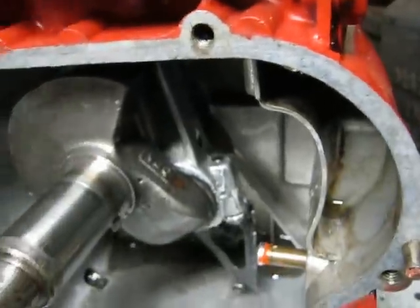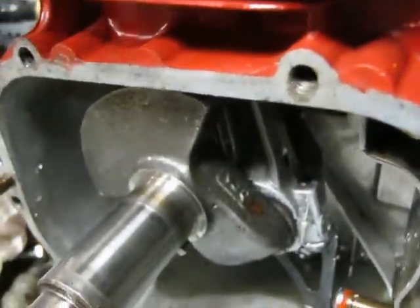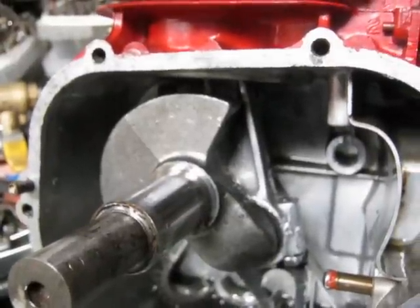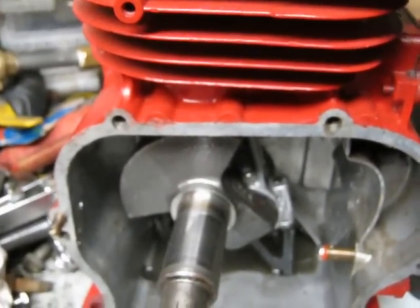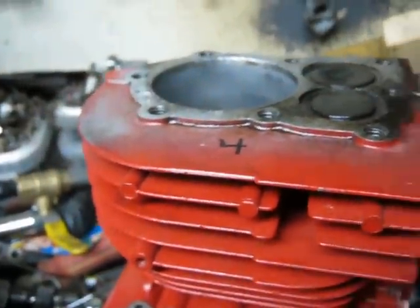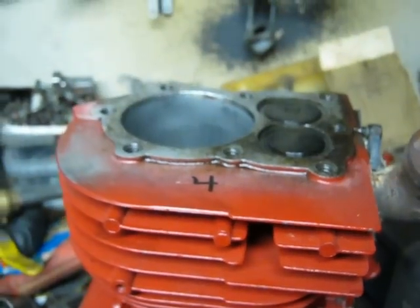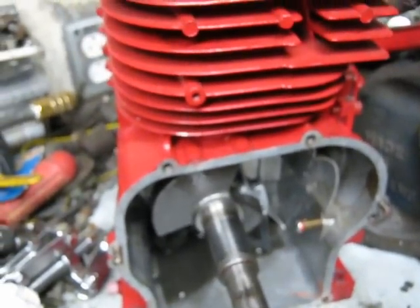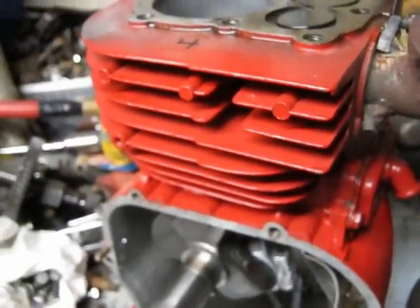The crankshaft is stiff too, so I think the connecting rod got tightened up a bit from all that pounding. This damage was caused from the gear letting go, and then the engine kept running on seven cylinders powering it. So we didn't run long — maybe 15, 20 seconds or something. But my son noticed a noise, and that's why on the video he puts his hand over the exhaust to find out what was going on. He said there wasn't any exhaust coming out of that cylinder. It turns out both valves were open and the piston was still going up and down, but there were all kinds of shavings in the oil — I was grinding a little bit of aluminum while it was spinning. Looks like I can salvage this cylinder. So not the end of the world. My next plan is to build a seven-cylinder engine, so I probably won't be using this particular engine anyway — we can get on with another project.